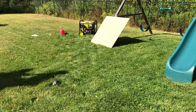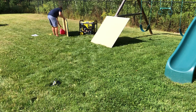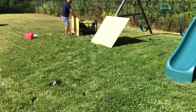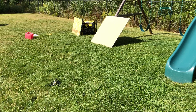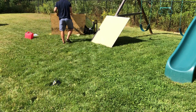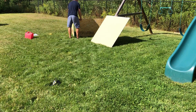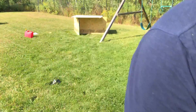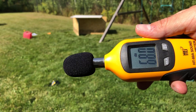Some people on YouTube think that it's a good idea — how's about we watch? So right here, I'm basically just doing what some people suggest: just putting some wood or whatever you have around your house. Some people say plywood, some people say drywall. It will work — it will lower the decibel count of the generator. The generator was around 90 decibels when I'm standing close to it. If I come back with my sound meter after I've built this little apparatus, my generator will be much quieter by a fair amount of decibels, as you can see.